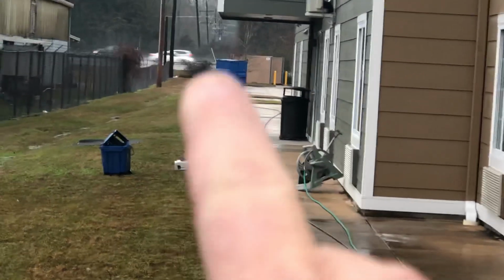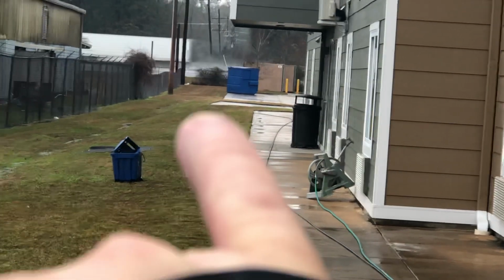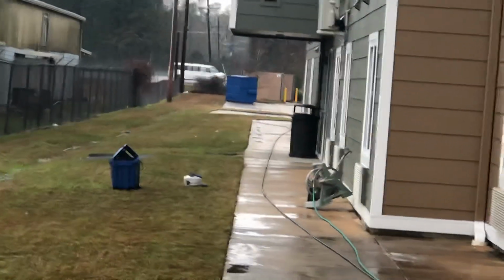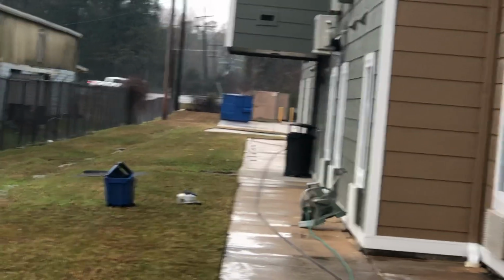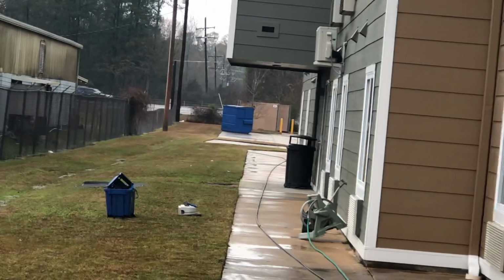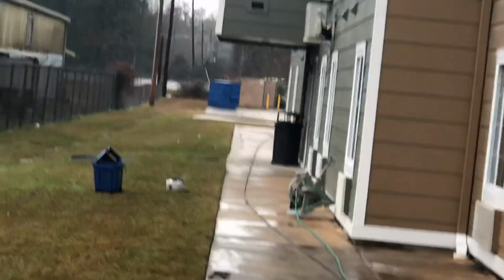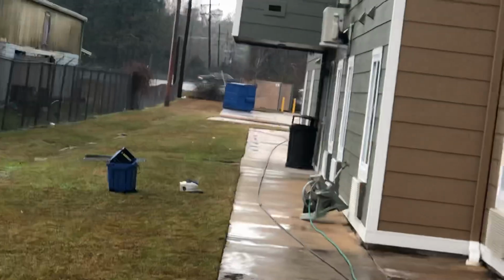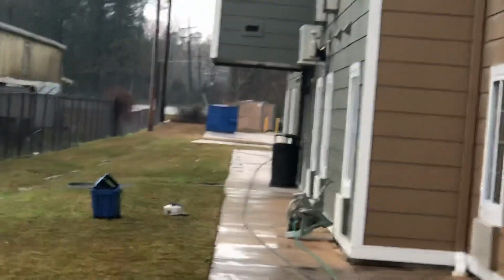Okay, this corner right here, you need to have some slack there, and the reason being, you need to have at least 5% of your hose length, because when this 4,000 pounds of pressure, or 3,000 pounds of pressure, on this surface cleaner hits it, that hose, being this long, wants to expand and contract. Now, if it's wrapped around that corner down on this end really tight, as it makes that right hand turn, it's going to be a tight point.